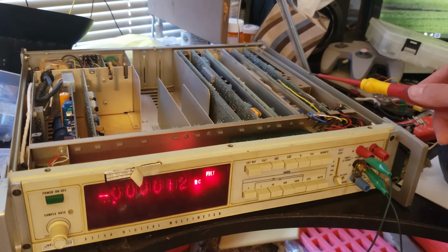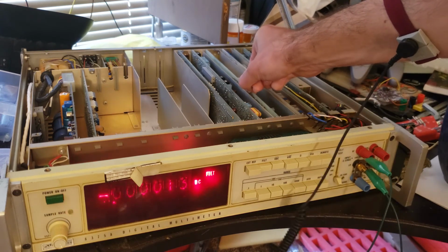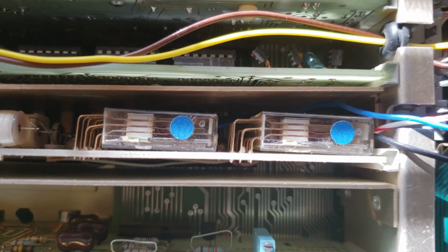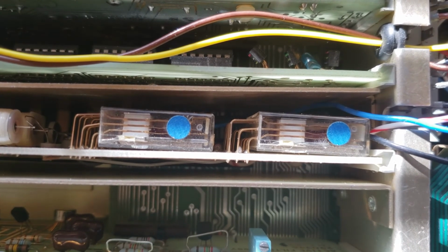Unfortunately, I can't find a good replacement for that relay, and replacing it with a modern relay is going to be a huge amount of work, so I think I'll just live with it. Typically, signal relays like this have gold-plated contacts, and I'm guessing that over years of clicking on and off, the gold has worn away, and whatever base metal the contacts are made of has fretting corrosion. The contact resistance now changes a little bit every time it moves, just like in the switches earlier.